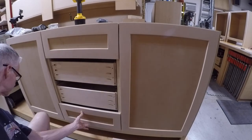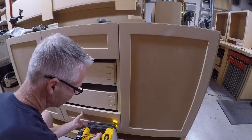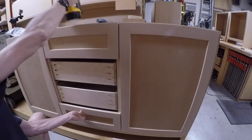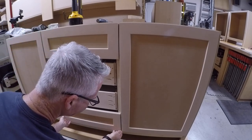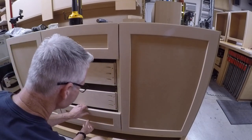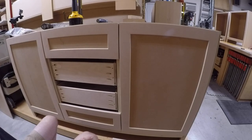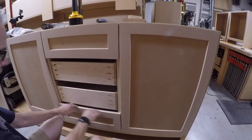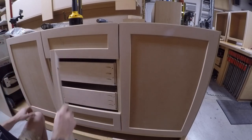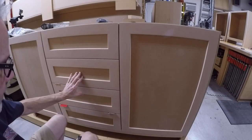So now we can go to the next one. That's good right there. And these have adjustability also. Did you by any chance see that drop just a touch? They always do. All right, that's good though. I'm going to go ahead and lock this in. It's nice and tight. Keep an eye on the layout lines. Everything seems good. Now in here, there's two ways that I can do it. As I'm doing this, I can put spacers in here to raise it up, and I'm going to tack this right now.